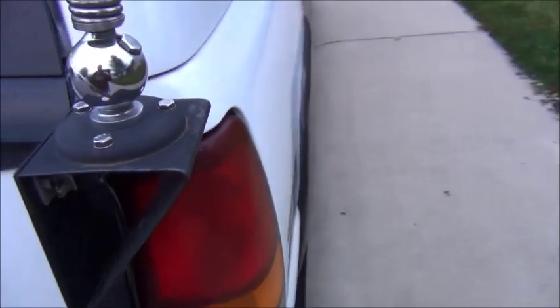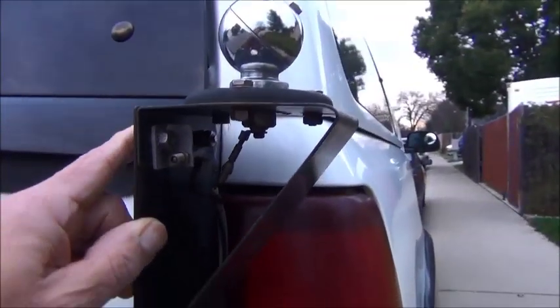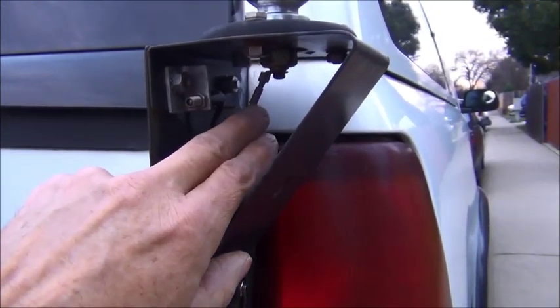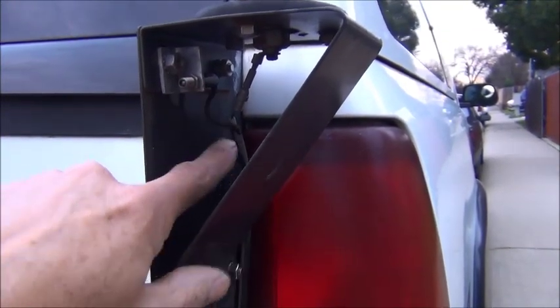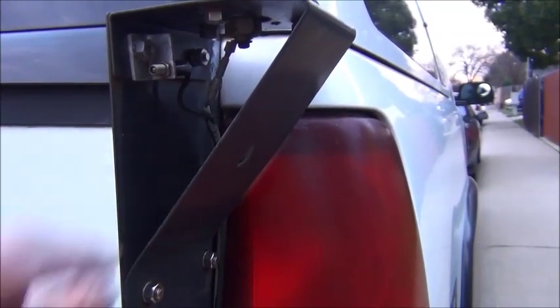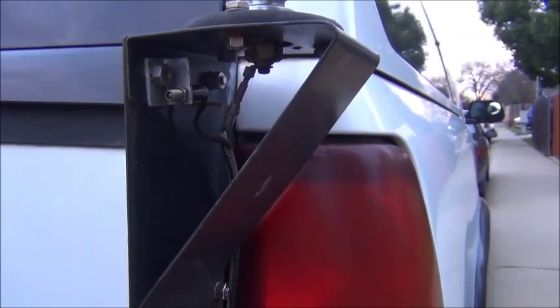I have done quite a few experiments with this, and so the feed point I've left with that experimental mount, which is basically just some banana plugs — one banana plug for the ground and one for the feed point. I'm sure this affects the antenna somewhat, but it can be easily disconnected and another antenna put on there.